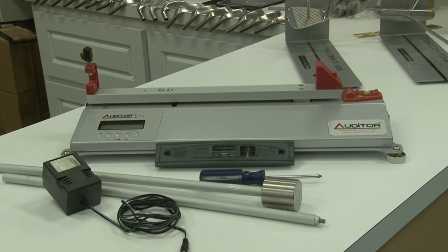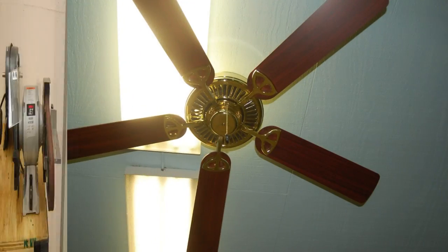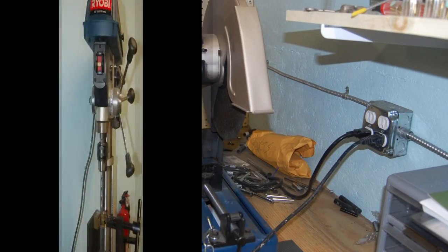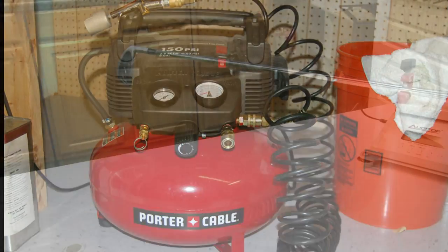Auditor Speedmatch MOI Machine Setup. First, let's find a place to set up our machine. We need a place free from air drafts, from electromagnetic field creating devices, and keep away from vibrations. Any machine that causes a vibration will cause a problem.